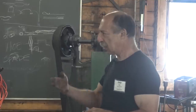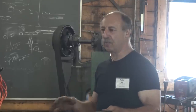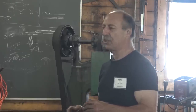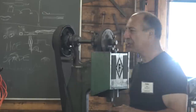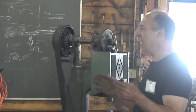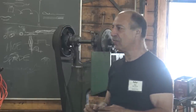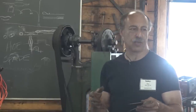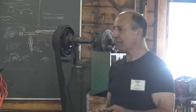If you want to get a better quality piece, you get rid of the forged surface by filing. And if you want to get rid of that medium grade surface and make a better quality piece, you polish. And if you want to get even better than that, you case harden and polish. So there are many, many grades of surface, each one better than forging or the one previous. And each one takes a significant amount of labor and sometimes more skill to achieve.